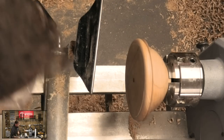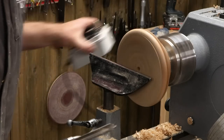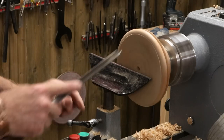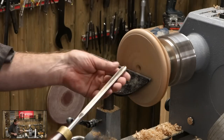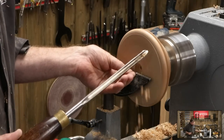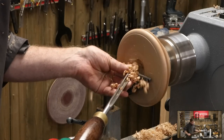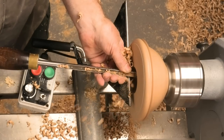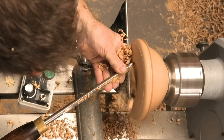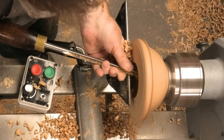Come round the corner, let's move the extraction nozzle in. Checking our height - back to that half-inch gouge again. Working in the middle, bring the control box down so I can reach it. Centre - just come down a tiny little bit. That's better. Then we can start hollowing. Finger and thumb on the left hand. Bring the hand about the wood, line up the bevel, gently travel. Speed-wise we're about 1300 RPM at the moment. We can travel with the body movement. Handle out wide.